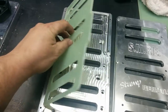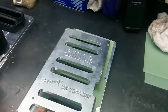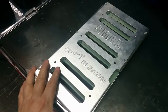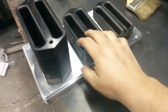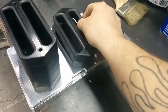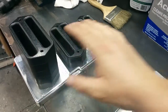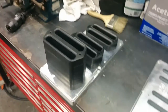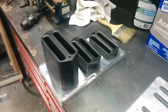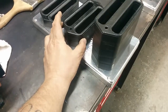He basically just wanted me to do the main base and the outer cover piece. So the slide goes in there. This other cover piece gets bolted to the top of the slide, like so, with bolts around the perimeter. And then this is the other setup over here. These are 1-inch thick Delrin blocks, and they basically copy these slots, and they're different heights. This one is 1-inch, 2-inch, and then 5-inch, just 1-inch blocks all stacked up, and then bolts go through here and bolt to the plate. They're staggered like that apparently. Something to do with flow with the engines, I'm sure, but I don't know enough about it to tell you why. That's what they wanted.